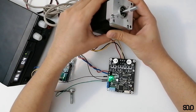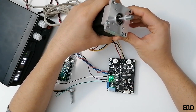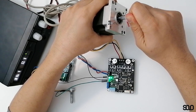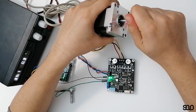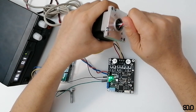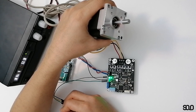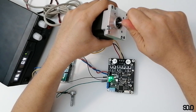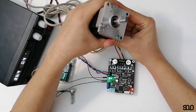Back to the torque control — now I have almost the minimum amount of torque on this motor. It's rotating with a very high speed — actually near the nominal speed — but it doesn't have any power. You can see that I can easily grab the shaft with my hand. Although it's spinning fast, it takes almost no force to hold it. That's the minimum torque. Now if I increase the torque further, it's much harder to grab the motor because there's much more torque.